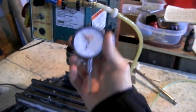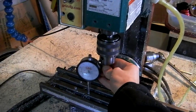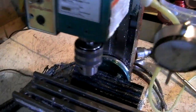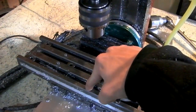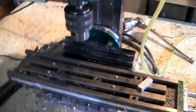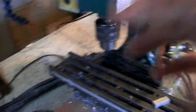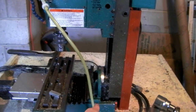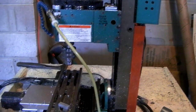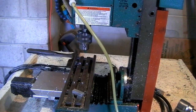To measure it, I'm using a dial indicator — as the plunger moves up, the needle moves. I chuck this up and rotate around to touch front and back. Previously, the discrepancy was 17 thousandths of an inch higher on one side, so the machine was tilted down 17 thousandths on that axis. It took me a lot of calculations to figure out — basically a square relationship between the pivot point and how much lift at that edge equals 17 thousandths. I'll bolt it together and we'll try it out.